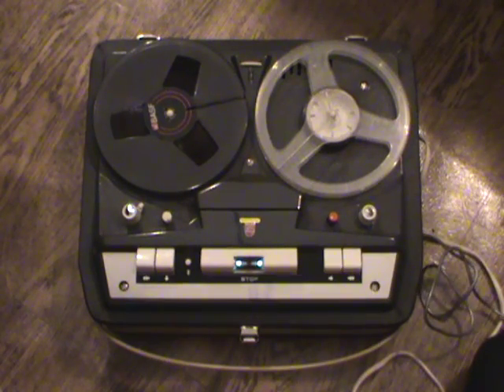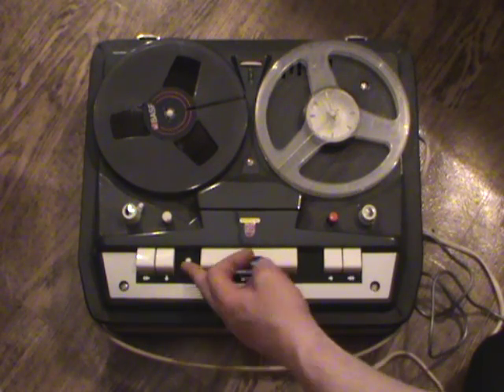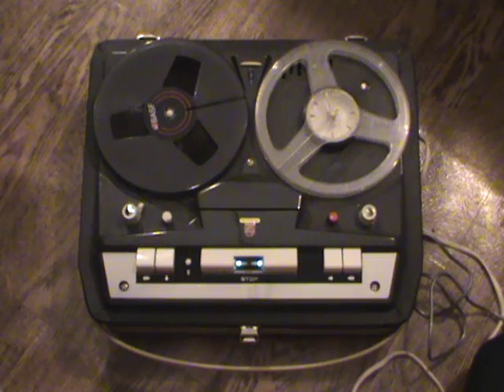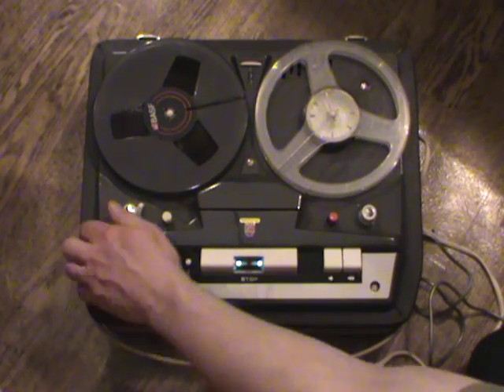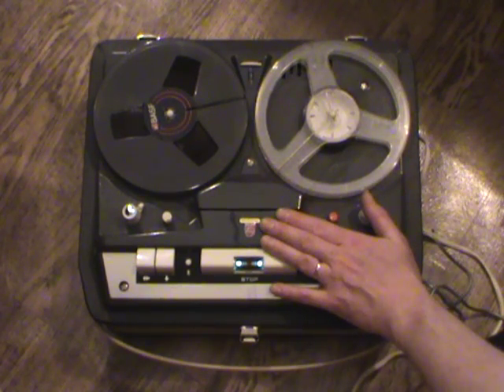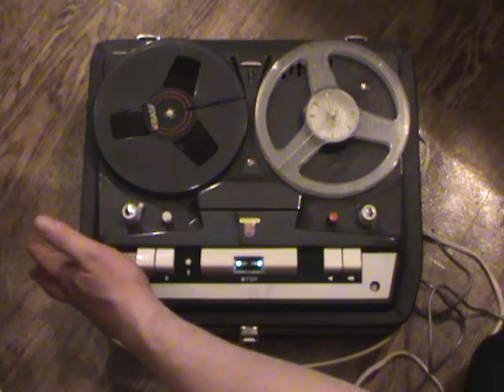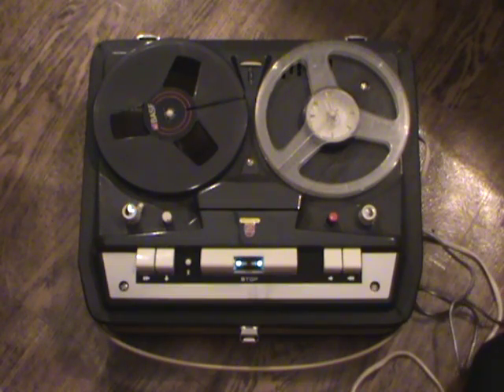You can hear both tracks at the same time — it's like a trick button. Not all versions of this machine have a trick button that operates this way. On some machines it disables or lifts the tape from the erase head, meaning you can make a recording on top of an existing recording. There's also a stereo output where you can connect an external amplifier to play back one channel internally and one externally, and in that case you can likely listen to one track while recording another, effectively performing some sort of multi-tracking.